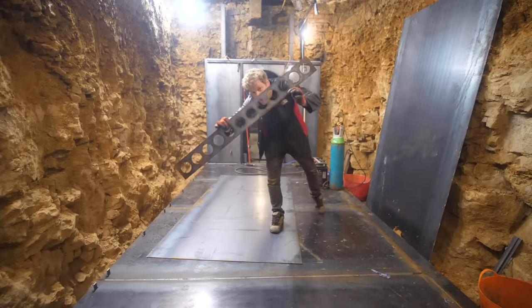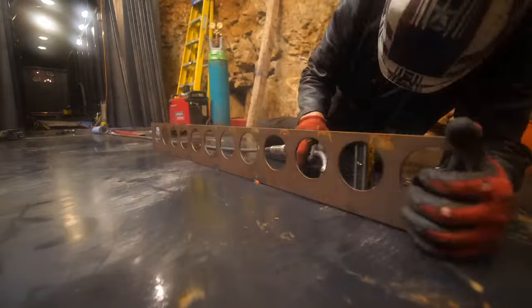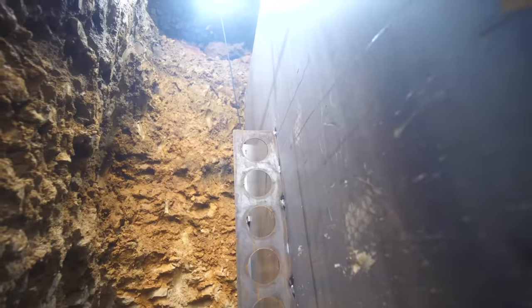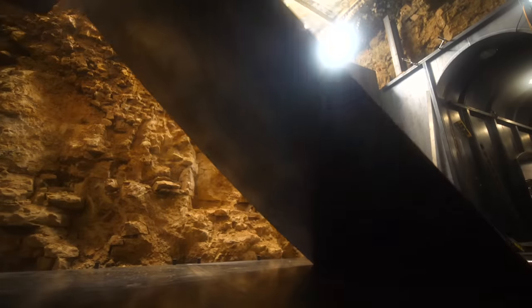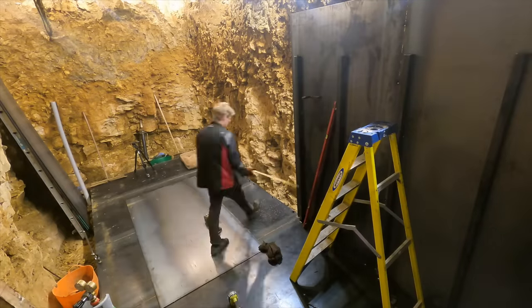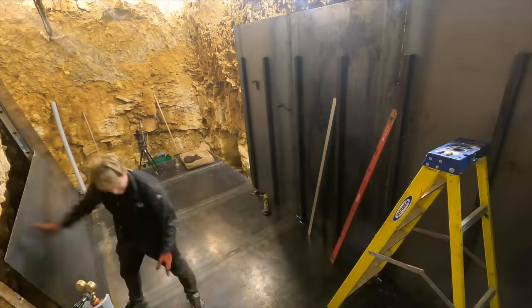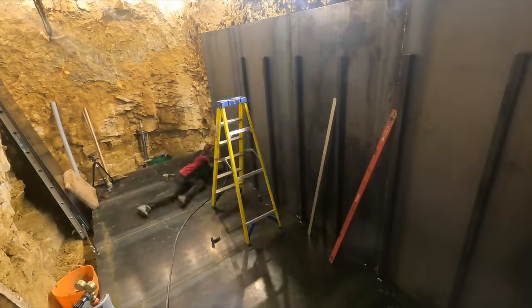Welded to the back of each wall sheet is what I call a concrete plate - a nice thin flat plate full of holes in it. So when the concrete comes down and swells around the steel, it goes through these holes and properly stitches the flat sheets of steel to the concrete wall block behind it. I'll place at least one of these on each sheet, always behind the upright beams for strength, but also so you can't see the weld scorches coming through on the sheets adding blemishes.